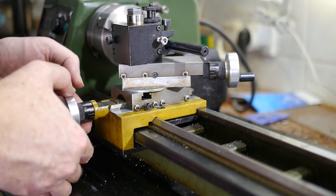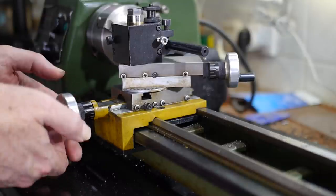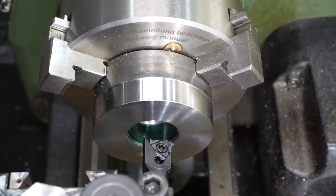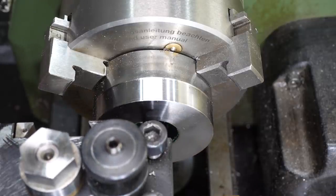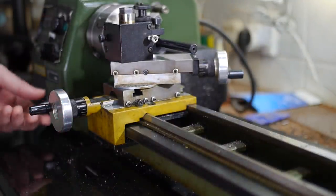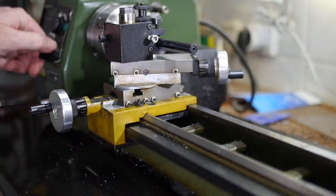The tool is now at the right position for the first pass, but I needed to back it up 2mm to be able to run it cleanly to the starting position in the gutter at the bottom of the hole. I found the gutter by touching the tool holder against the bottom surface of the hole, then bringing it back 1mm, and feeding the tool 2mm forward again to return it to the right starting position. I engaged the lead screw feed - it needs to stay engaged for the rest of the thread cutting, or the alignment will be ruined.